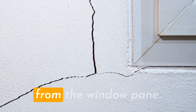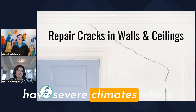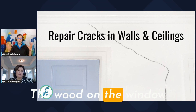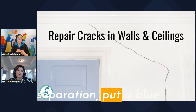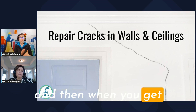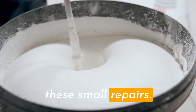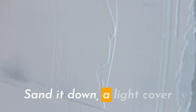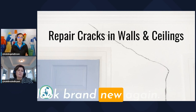If the windowsills are starting to separate from the window pane, a lot of times with the moisture in the air — if you have climates with cold winters and warm summers — the wood on the window panes will expand. Just go through and anytime there's separation, put a blue piece of tape on it. Then when you get your spackling and your caulking, come back through and make these small repairs: a little spackling, sand it down, a light touch-up paint. You don't even have to paint the whole wall and it can make the wall look brand new again.